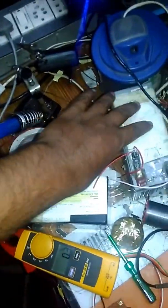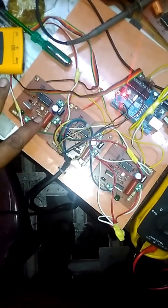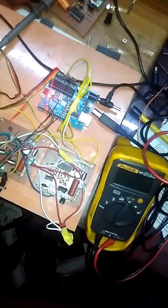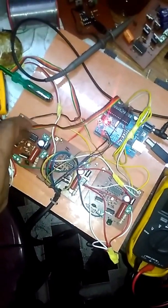I have used two UPS batteries of 12 volt 7A. This is my board — a three-phase setup with an Arduino board and a three-phase driver for driving the MOSFETs. I have used a FAN7392 gate driver and CSD19534 MOSFETs — six MOSFETs in total. There is also a 7805 regulator for 5 volt supply.